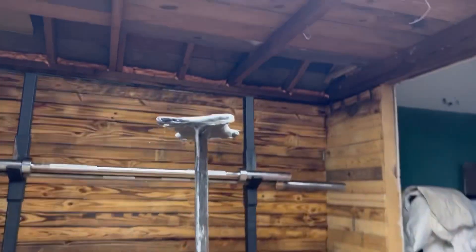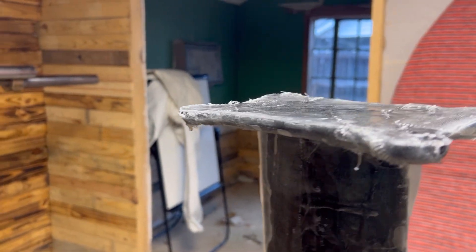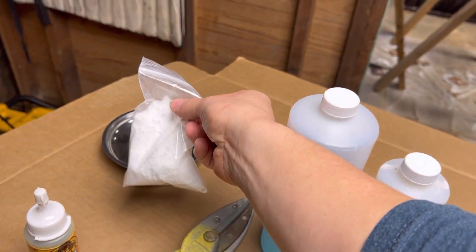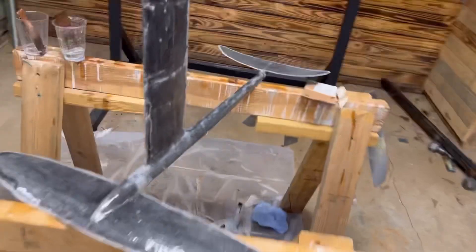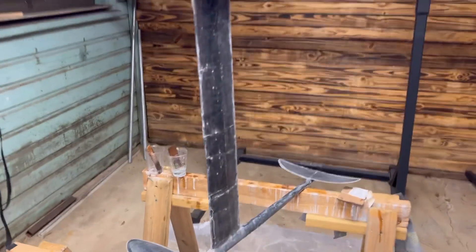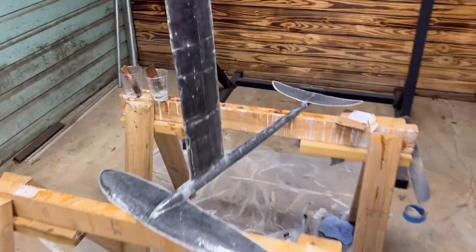So 80, 100, 220 — and you can see up here this all kind of needs to be finished around the edges right there. I'm thinking what I'm going to do is mix up some epoxy with this shredded fiberglass and paint it all around on the low spots. I have a lot of bubbles and air gaps around here — those might pop — so I'll just brush over the whole thing after I sand it and then give it one good sanding. Back here is really bad; couldn't really get that.